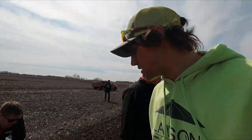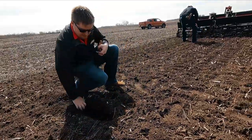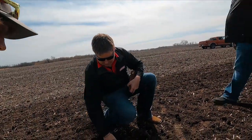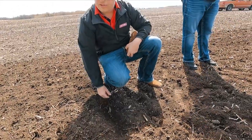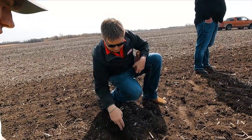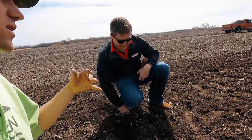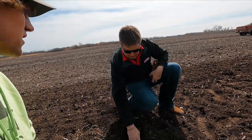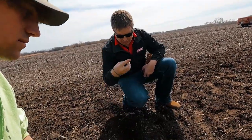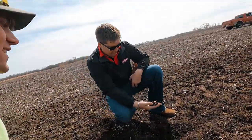Depth is consistent all the way across — three to three and a half inches. The rep explains: this is a vertical tillage tool. What you're hoping is to go and plant into a little more loose dirt, so the seed when it goes down doesn't hit a hard pan and have to go sideways. It should work itself right down through there — good picket fence stand, good seed to soil contact. We can go deeper with this than a field cultivator without bringing up mud, and with newer style planters you can put that seed right where you want it. Look at how mulched up it is — it's ready to go.